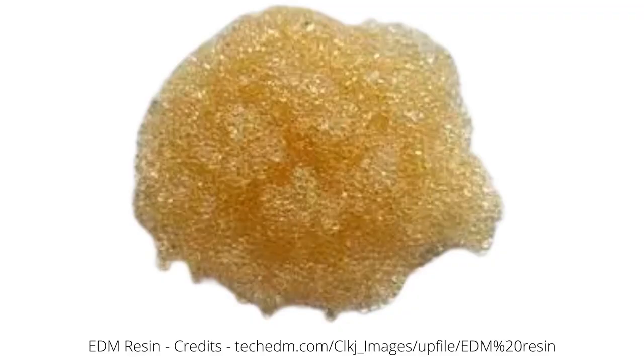The resin, or the bowl which is present with your wire cut machine, is there to remove the dissolved solids from the deionized water, so the deionization of the water is taken care of by the resin. However, resin is also an excellent filter. So if you use an improper filter with your machine, most of the dirt will pass through the filter and will get caught in the resin. Analysis showed that using 5-micron or better filters with your wire cut machine improves the life of your resin by almost 200 percent.